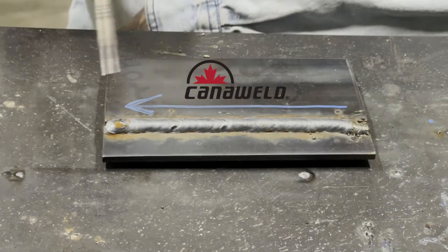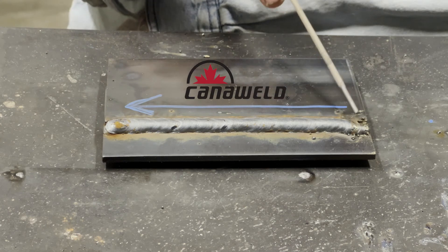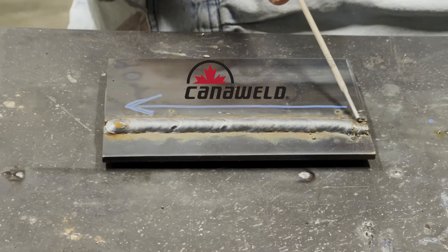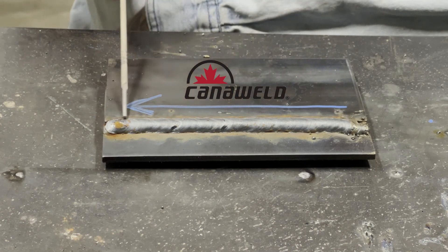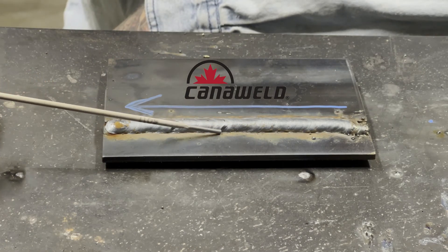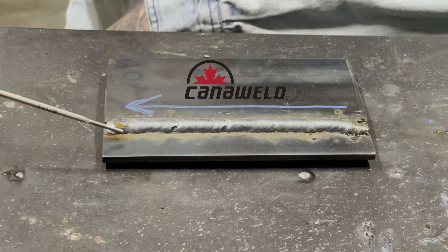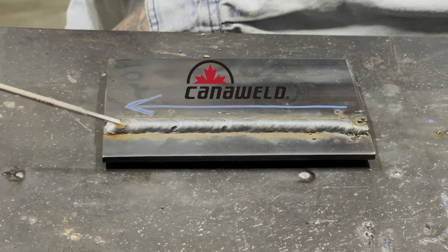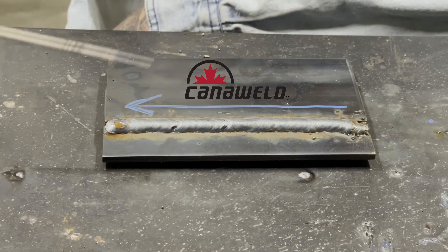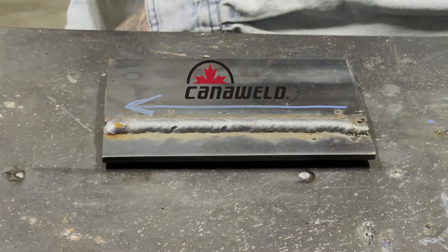So as promised, I flipped the ticket around so you guys can get a closer look at this weld. This was my travel direction — this was that huge ugly tack I started out on, so I was a little wonky, and then we ran all the way down. As you can see, I was moving a little bit too slow and I piled up some of my weld. What I could have done was move faster, or remember with the pre-settings you have that factor of 15 you can turn up and down. So for me, if I want to keep moving slow, I probably should have turned down that wire speed by a factor of 5. But all in all, it's a nice looking MIG weld and it will definitely hold — good to go.